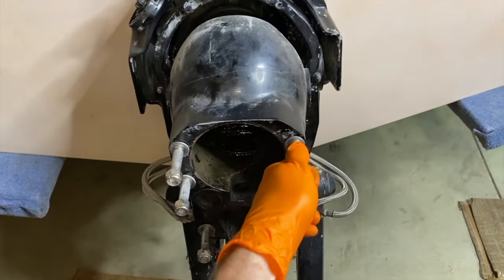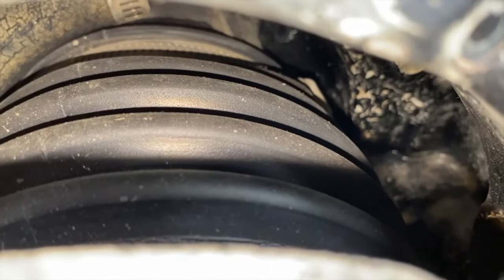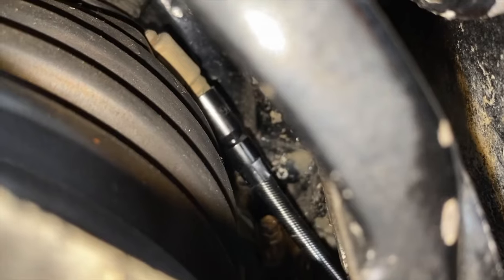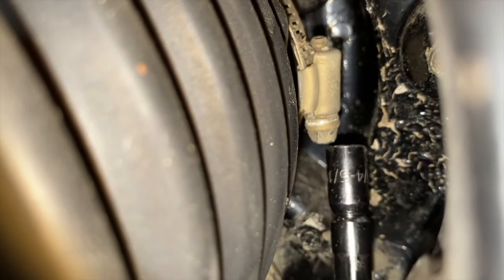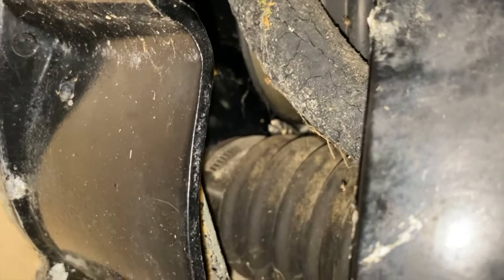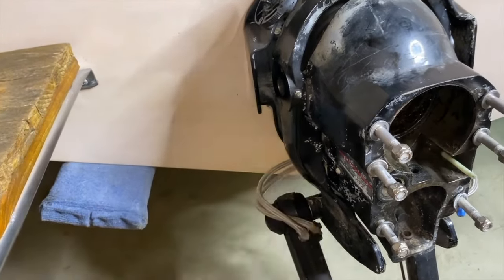I carefully pulled the bell housing outward to widen the gap between the bell housing and the gimbal ring. Now we can come inside and see the U-joint assembly bellow. On the back side is a large worm gear clamp, and to the right of that you can see the securing screw. Go ahead and grab the adjustable shaft screwdriver with a quarter inch and come in down below — position that quarter inch socket on the worm gear screw and carefully begin unscrewing. The clamp itself is now loose. What I did next was carefully shift the bell housing and gimbal ring starboard side or to the right, which opens up this area to allow us to gain access to the internal water tube. Check that water tube out — badly damaged, dry rotted, and begging for replacement. Here's the tool I'll be using; a link to purchase this is below. This will be great to shift into that little gap to cut the water tube. However, if you don't have that tool, a standard utility knife will work as well.